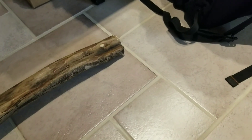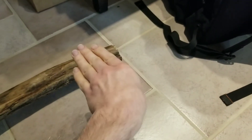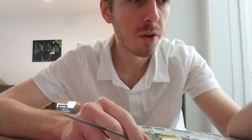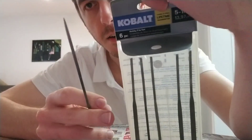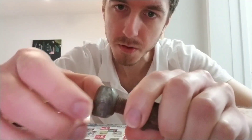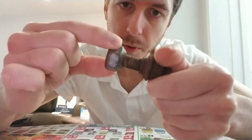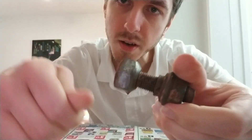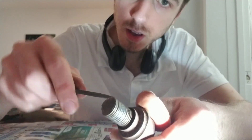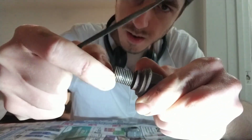Once I'm satisfied with this, I can start working on the end of that handle — tapering it down, cutting a slit in it, and then actually punching a hole through everything to fit this bolt. I'm just going to take a needle file, go through the threads on this bolt, and start cleaning them up until I can get enough clearance to freely move this bolt as far down as I need. I've been at this for maybe 45 minutes or so and I think I'm making progress.